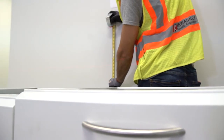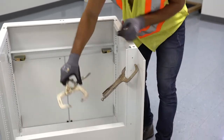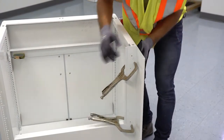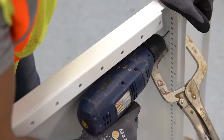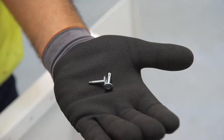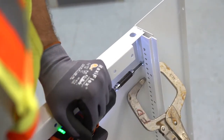The line can be marked with a laser level or a standard level. After leveling the cabinets, the next step will be installing filler panels if there are any on the end of the cabinet runs. If the end of a cabinet run is exposed, filler panels must be installed prior to installing your first cabinet. The filler panel should be fitted to the cabinet with clamps, flush with the cabinet side and top edge, and attached from the inside of the cabinet with half-inch self-tapping screws. It is important to attach from the inside of the cabinet so that when the work surface is installed, the filler panel can be removed to provide surface space access from behind the cabinets.